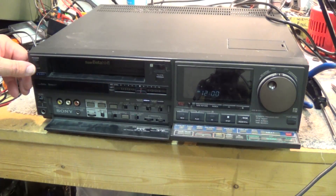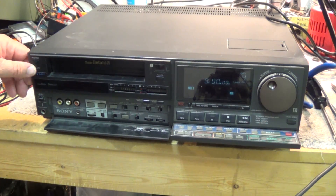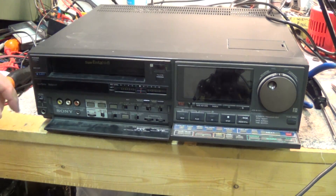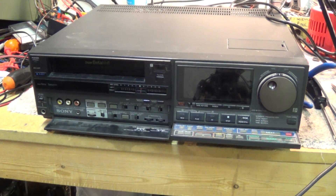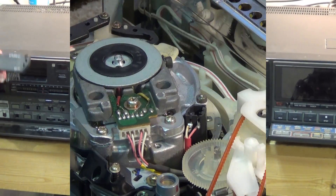Note when I press the power button, the clock display lights up, the time display lights up, but the power light does not come on. There's the problem — the regulator has failed. This is a quick way to tell: if the power light doesn't turn on but the time display does, the system control thinks the machine is on but there's no power coming out of the regulator because the regulator has failed. The part that's failed is the good old STK5441.